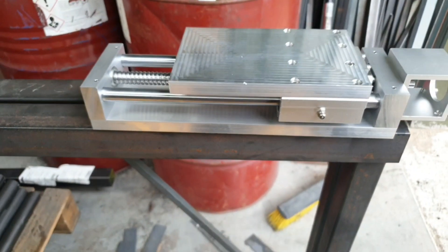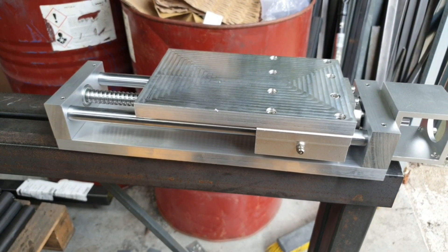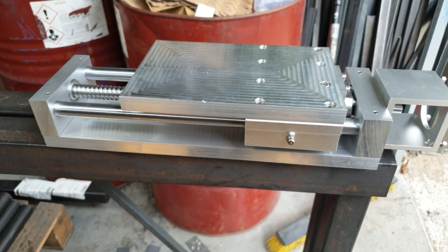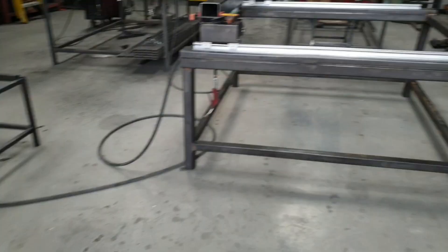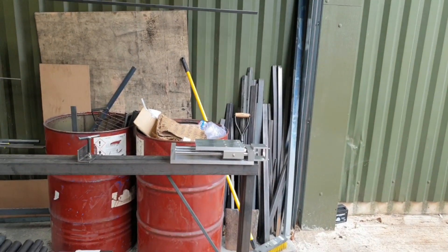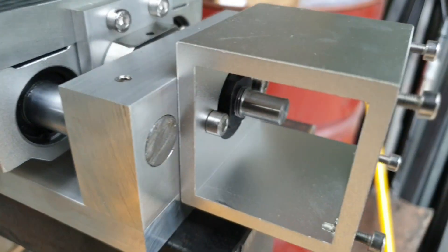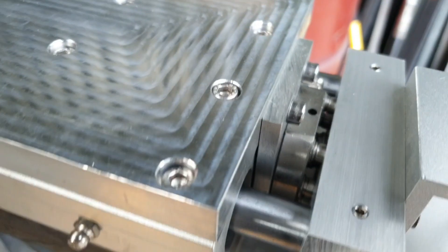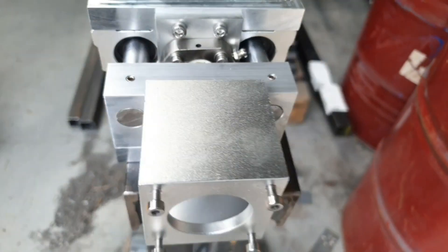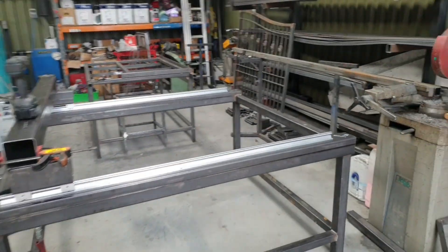Here's the lifter — thought I'd show you that. CNC For You do these lifters for about £250-300. Well worth it — don't bother trying to make your own. Just get one off those guys. The amount of time you spend making one: you've got ball screws to set up, all the bearings, all the other bits and pieces. You've got to machine all these surfaces and make sure you've got good surfaces. Buy it built, don't build it yourself — that's what I'd say.